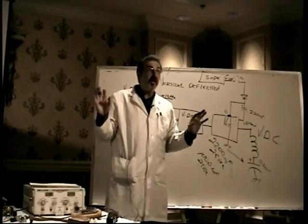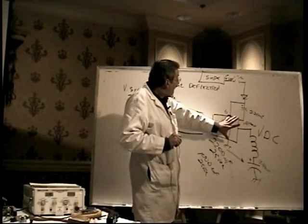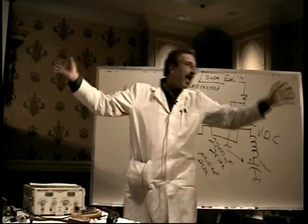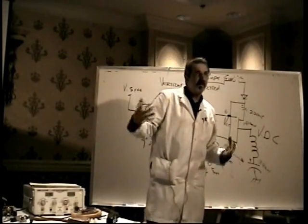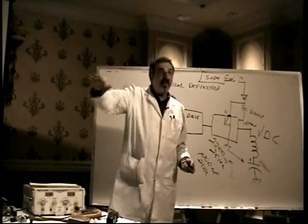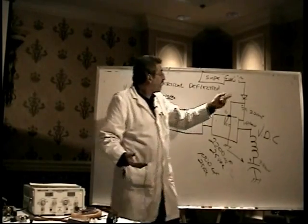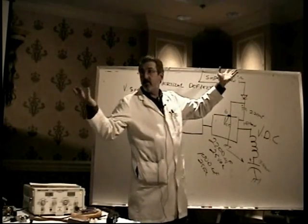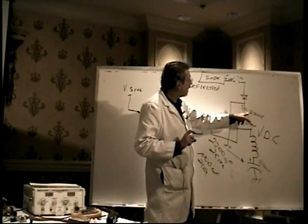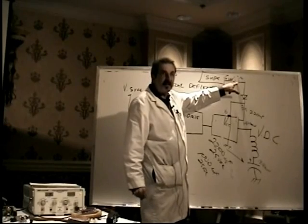That's a cool thing. That's a really important thing to know. The big clue here is that the output chip shorts and draws too much current across that resistor. But I've seen it again and again, where people bring a monitor into the class from the monitor lab, and we spend a couple of days on monitors just working on them in the class, has a flat line on the screen. I look at the board. He's obviously changed the vertical output chip. And then all that's left to do is change the boost cap and the resistor, and it works. So he really did find the bad part, but there was more than one bad part. That this part failing caused this part to fail, which then caused that part to fail. Just a chain of events. Okay, does that make sense?